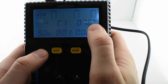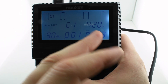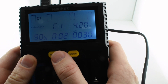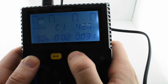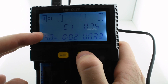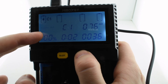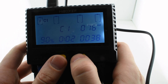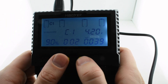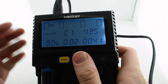I don't think it will charge at that pace now because the battery is at a high state of charge. Charging that fast at 90% would probably damage the battery. If you double-tap the mode button you can switch battery type if you have a different kind in there. Those are what I believe are the main functions that I'll use them for, but you can look up all the functions yourself in the manual.